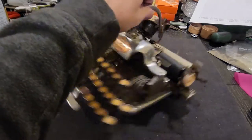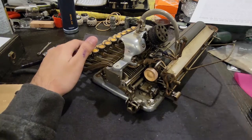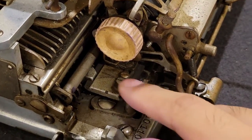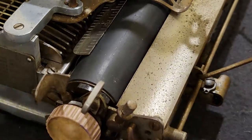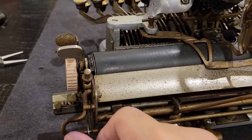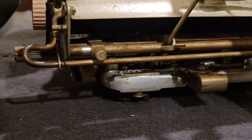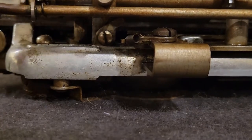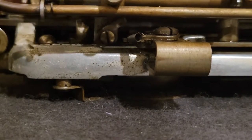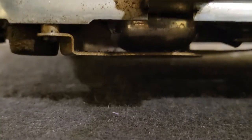And now inserting this footage before it's too late. So this machine, while it has a left margin, does not have a settable right margin. It only has the fixed tab over here for stopping the carriage from moving this way, hence why you can only remove the carriage, at least easily, from this side. But what you can set is this little bar here, which controls at what point you'll hear the bell. So that moves that little arm there, which then causes that striker to hit the bell.